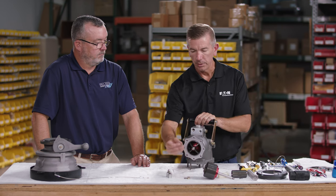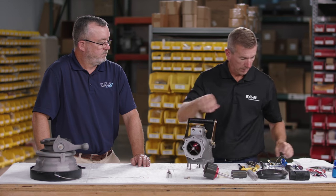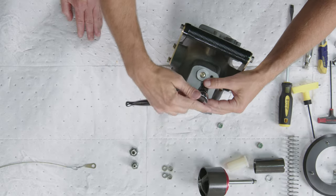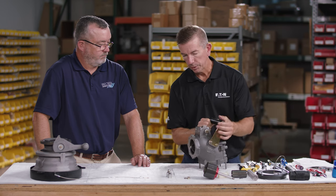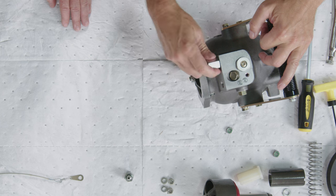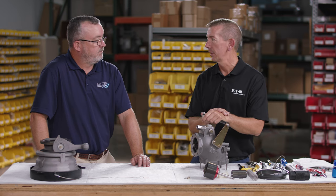With the closing time screw adjusted, insert the plug with a new O-ring and tighten it using a thin-walled nine-sixteenth socket — just until snug. Next, reinstall the reference pressure line connections. These are JIC fittings — do not use standard MPT fittings, which could strip out the holes. Use only Carter-approved JIC fittings, and since they have O-rings, don't over-tighten; install until nice and snug.